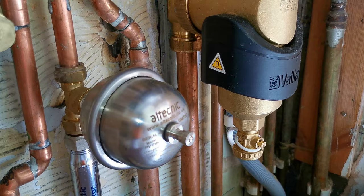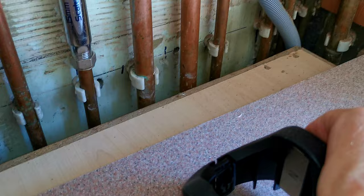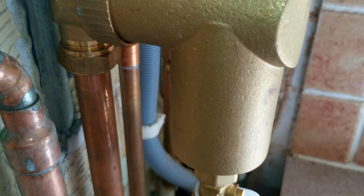We need to remove the magnet when we clean out the filter — it just pulls down. On the back of the magnet there's a clip which clips onto a little knob on the back of the filter body, so the magnet can only go back on in one position. On the back of the filter you'll see that little brass knob which is where it clips on.